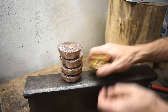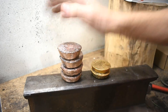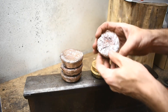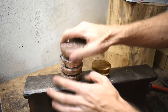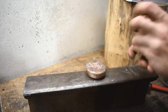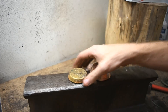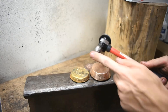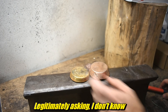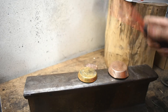And here they are! These are leftover aluminum bronze ingots — I think these are from the pour where I made the hammer. And these are the tin bronze ingots. They're a little bit different color than copper. These are very heavy — bronze is denser than steel, so it's very, very heavy. I'm gonna run a couple of comparisons here. For one, the color is different — aluminum bronze is more brassy looking. And to test the strength, I'm gonna whack this with a pick end on this hammer, then whack the other, and see which one causes a bigger dent. Now, these were both poured and dumped into a bucket of water, so they were quenched as ingots. I don't know what that does to the different alloys. We're gonna do the hammer test. I'm not a scientist, but I can use a hammer.